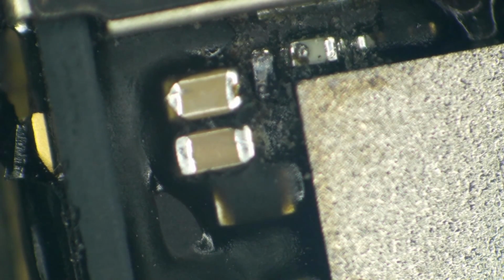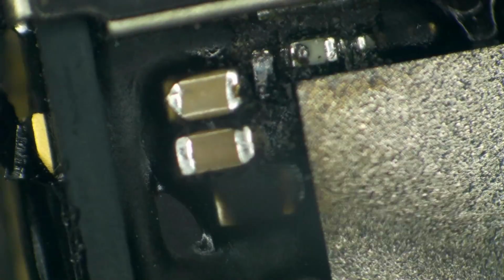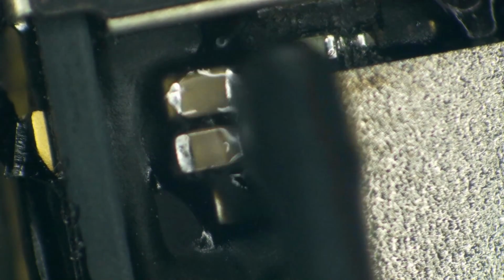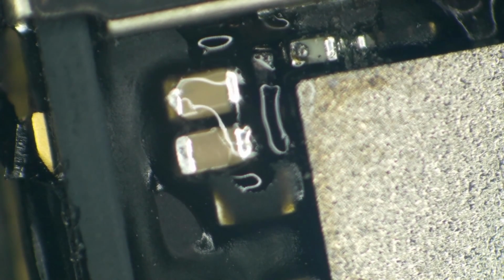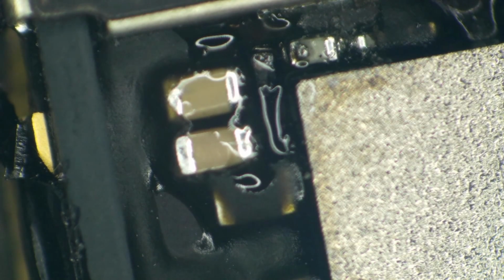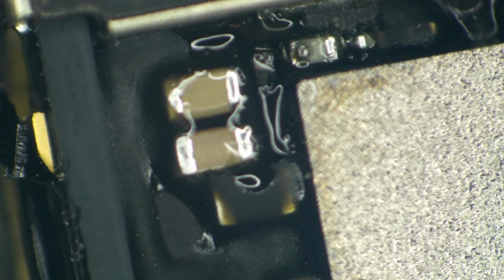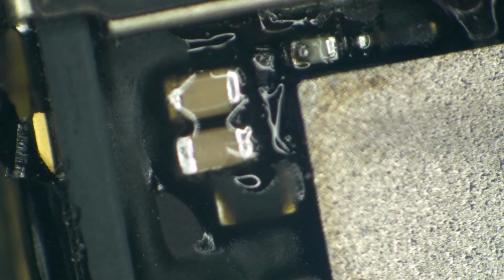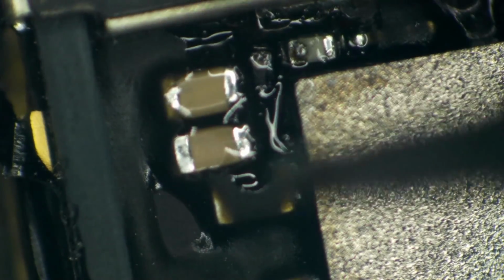Okay, let's see if we can get that burnt little filter out of there without damaging anything. I'm actually worried about the pad that it sits on. I don't feel like running any micro jumpers, and if I can get away with just soldering something on here, that is by God what I'm going to do. So we're going to get down in here with our micro pencil. This is the Hakko FM-2032 with the 0.1 millimeter conical tip. Links in the description.